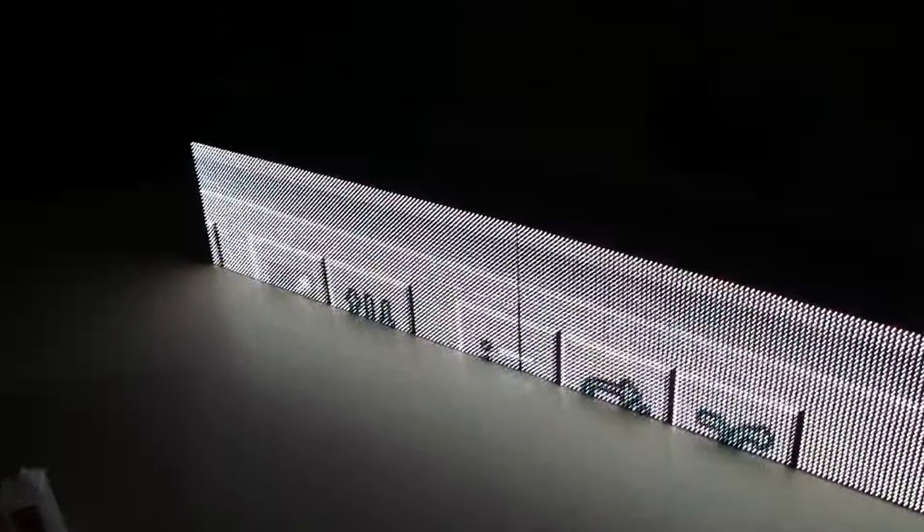And on the back side, there's basically 160 amps worth of 5-volt power supply driving the modules. The modules chained together, and then the Ethernet board drives into that. So it's been a fun project, but it just encouraged me to want to build more and more of these so that I can build a larger and larger display.